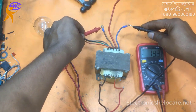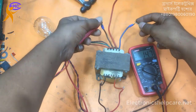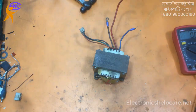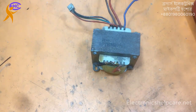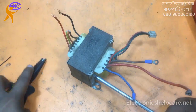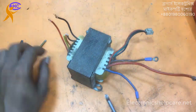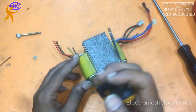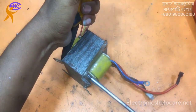Now I am going to use black and orange. These two give 14.5V; this pair is also 14.5V; this pair is also 14.5V. We are going to make it — we need DC 12V. For this case we are going to make it AC 11-0-11. We need DC voltage 12 to 14, so we cannot make 12-0-12; we have to make 11-0-11. Then when we use diode and capacitor it will be approximately 13.0V DC.